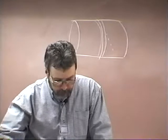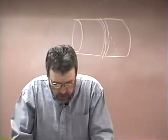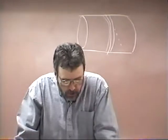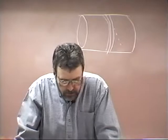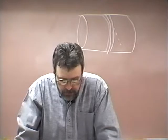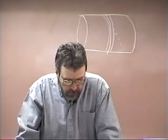Next page, figure 8.4 illustrates a typical deposition of the weld beads in a joint when welding a cross-country pipeline. As usual, four tack welds are made to hold the pipes in place, following which the root bead is welded, starting from the top of the pipe and welding to the bottom.